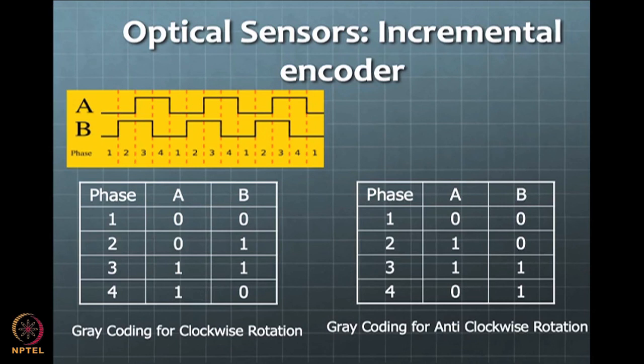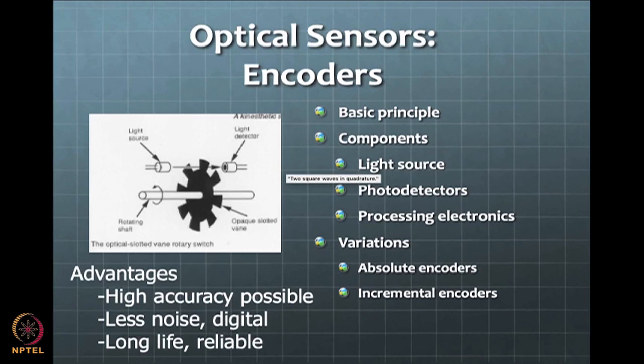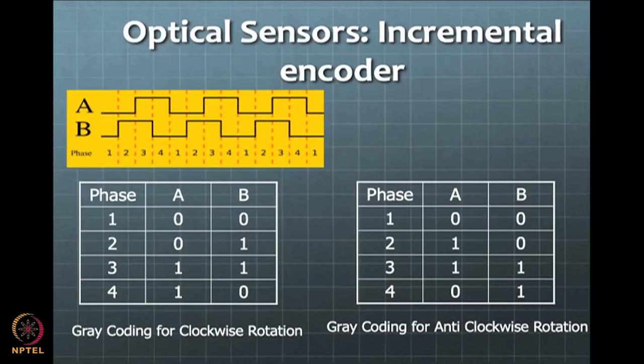You can take a pause here and then use the slits as I have shown here in this diagram, and actually put the two sensors such that you have the A and B output coming as shown in the first kind of way, when the forward direction motion is happening. And now if the direction of that wheel is reversed, and the sensor position is just kept the same, then what kind of signal do you expect to come here is what we want to understand.